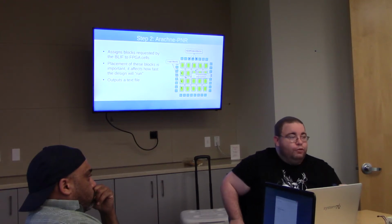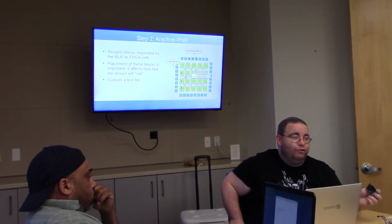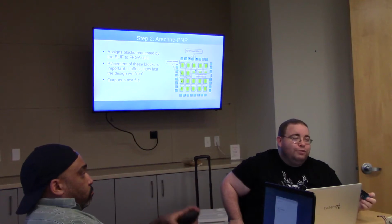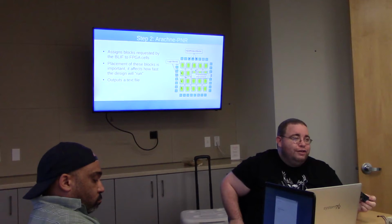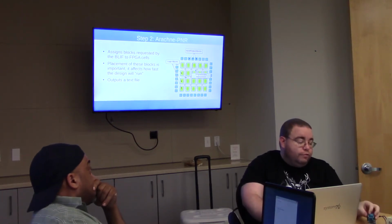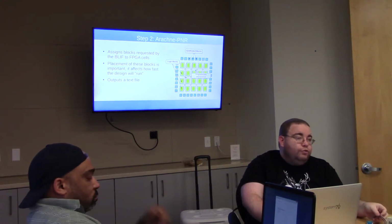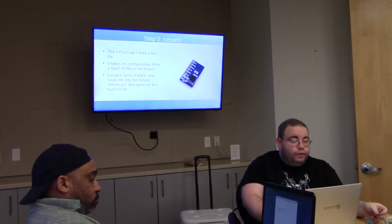Yosys supports tri-state pins. Yosys makes a netlist file that calls for tri-state buffers, it infers them correctly, they work fine. Arachne will not place and route them. And it will silently not place and route them. It caused me to waste an entire Sunday trying to figure out why. NextPNR places and routes them just fine and works great. So don't use Arachne, use NextPNR. Other than that, there's really not a lot of difference that I've noticed. These are both tools that take a thing that you're not writing directly and put out another thing that you're not reading directly, so who cares?